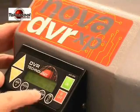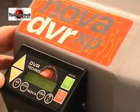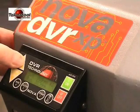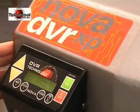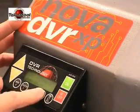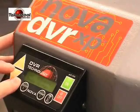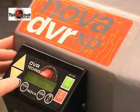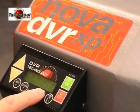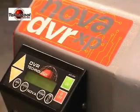If you decide on a speed you want, you simply hit P to confirm it, then hit on to start — and you are rolling at 750. If you want to go to a higher speed, like the original DVR, you simply hit the up keypad and increase that speed, let's say to 875 RPMs. If we wanted to make this speed number 3, we would hit select and P to confirm it, and this is now speed number 3. We can go back up to number 3 and it reads 875, as we have now programmed it into what is called EPROM — Electronically Programmable Memory — and we confirm that and are now rolling at 875.